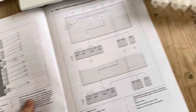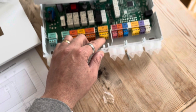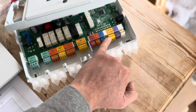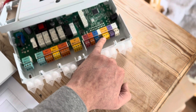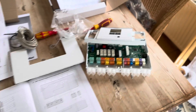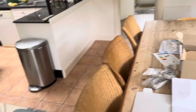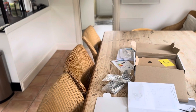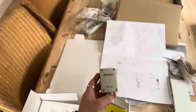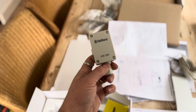There are your bus connections on there. DCF AF is for the weather compensator — they've got a weather compensator on all heat pumps. Typically they should go on a north-facing wall, out of direct sunlight, so you get the best possible weather compensation. That's what that is there — your weather compensator outside. It just mounts up on the external wall with a flex, so it's got three cores coming into it. Pretty straightforward really.